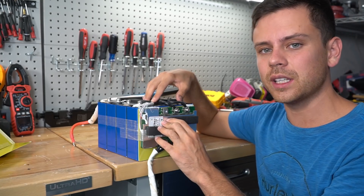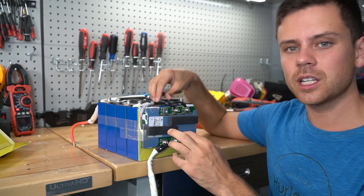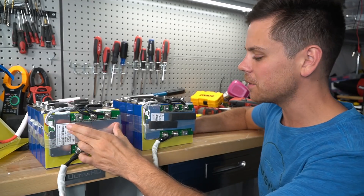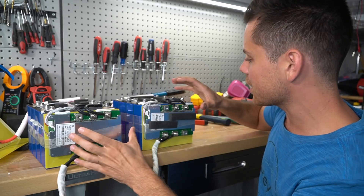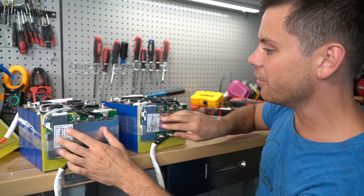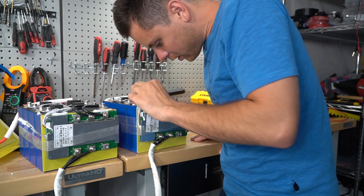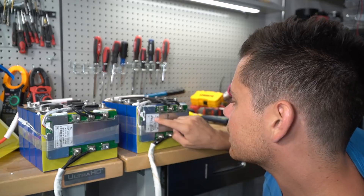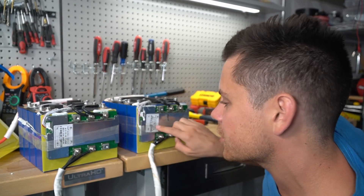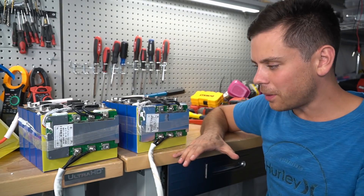As I've covered in my previous videos, Chins, Ampere Time, and now Zooms batteries do not have low-temp charging protection. If you're using this in a cold environment, be sure to use a solar charge controller that features low-temp charging protection. Here's the Chins battery we tested about two weeks ago, and literally everything is the same — the BMS connection points, foam placement, everything is identical. Even the barcode on the cells is the same: B01, 0404, 284, 2844. These are clones of each other.